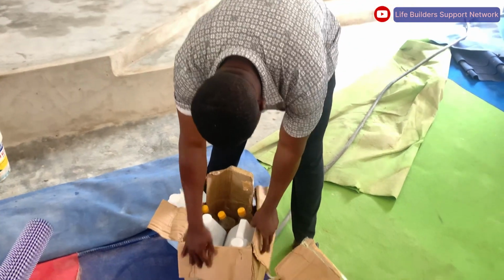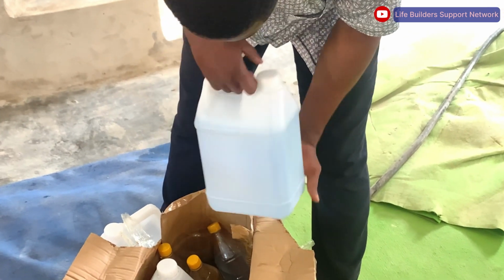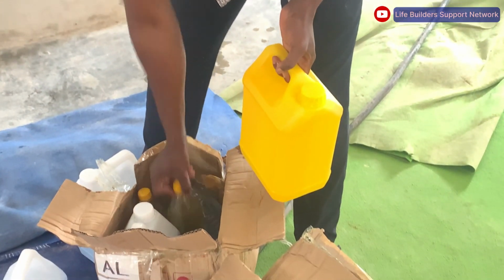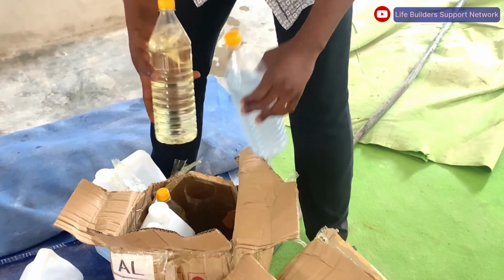So guys, we have here our chemicals. In 3D epoxy designs we use resin and hardener. This is resin, this is also resin, and this is hardener. The same as this one, this is hardener. We are just going to mix this in a ratio of 3:1 for our priming. We do the calculation of the floor, the size, then we use that to determine the quantity of chemical to apply for each stage. With the priming we are going to use 6 kg for this floor,